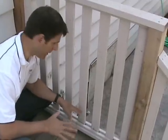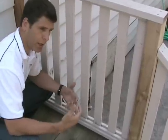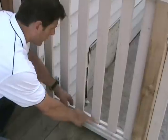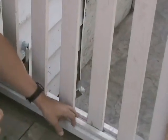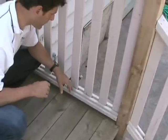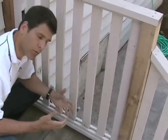In a rainy climate, particularly here, when you build wood railings, you've really got to think about how you're going to ensure that they can avoid premature rot. Here we've got 2 1x1s or 3/4 by 3/4 trim pieces holding these pickets, these balusters in place, and water's going to pool in here. So this is like a lab experiment on how fast can you rot a deck rail. What should have been done, if they're going to go with this, which is questionable, they could have drilled holes through the center here, so at least it promotes a little water flow. You should also consider that.